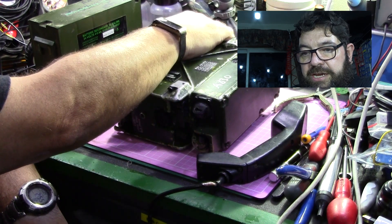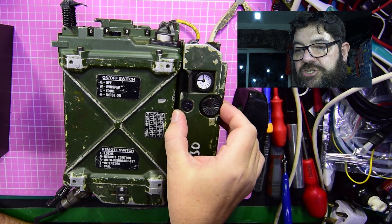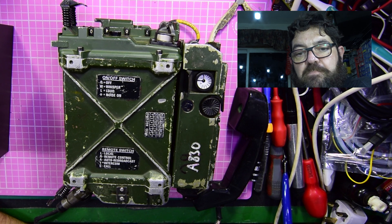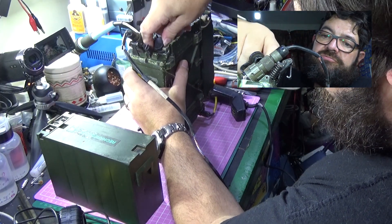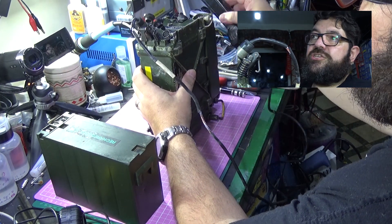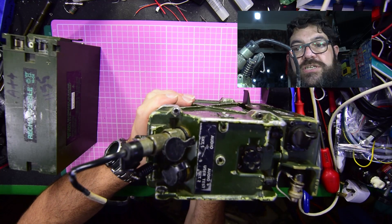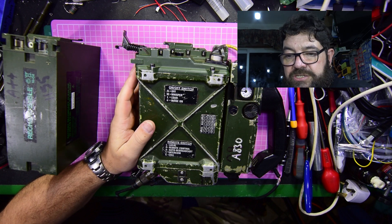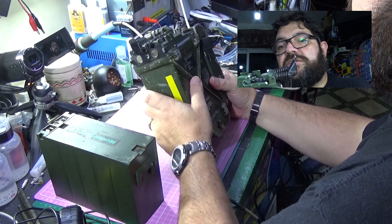What you did was tune up your radio first, then tune up your bandpass filter using the switch dial on the top here. You push it and it would turn — you can't just twist it normally, so when you let go, it's locked in position. You've got a handset which plugs in, and you can actually plug in two handsets. Not only can you have your headset with your mic connector, but you can have your commander using the remote handset, or he could have an extension speaker. The same radio was fitted to Land Rovers for vehicle-mounted use, fitted with the TURF and mounted on the rack.